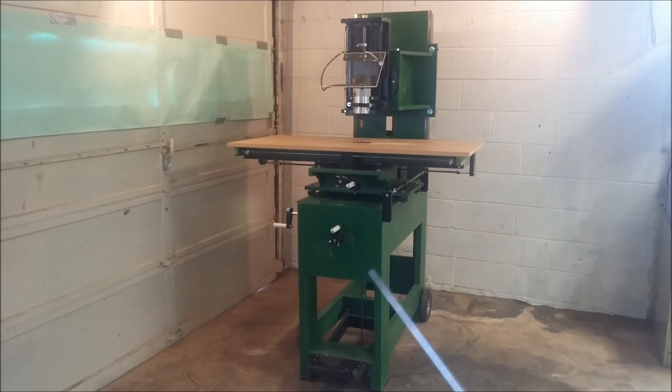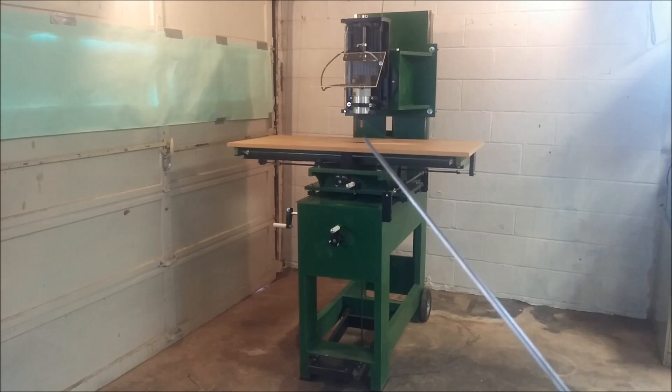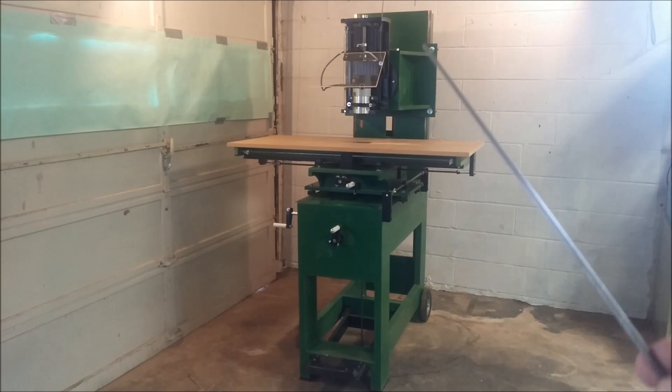The frame itself is made out of laminated three-quarter inch cabinet grade plywood. All the joints are half-lapped and gaps are filled in on the other side. The inner part is sanded smooth and filled with any filler to give it a smoother look. The back in the tower area is all connected together very tight. There are actually three layers from this section up to help prevent any twist — if the router grabs too hard and wants to push over to the side, it's pretty much eliminated.